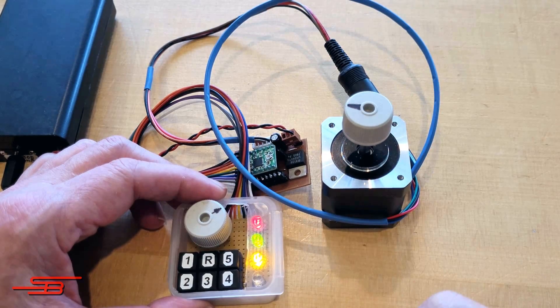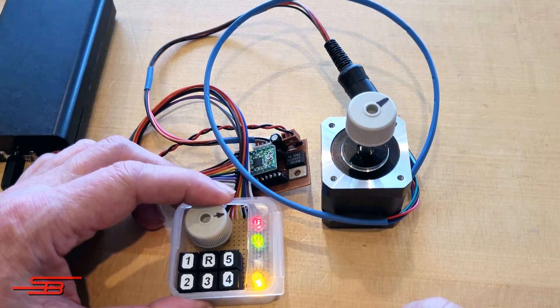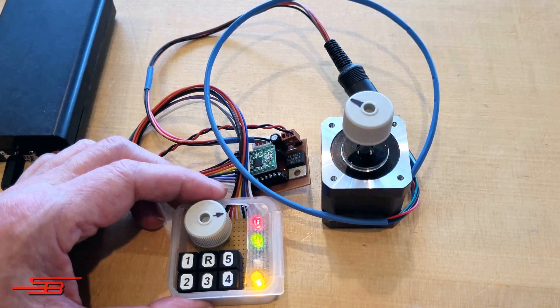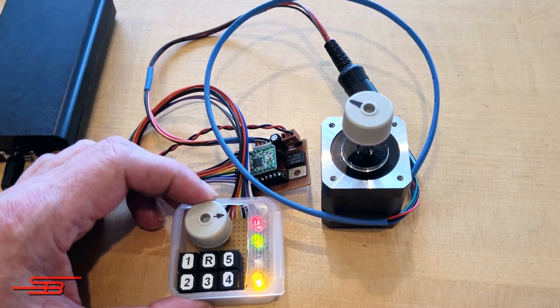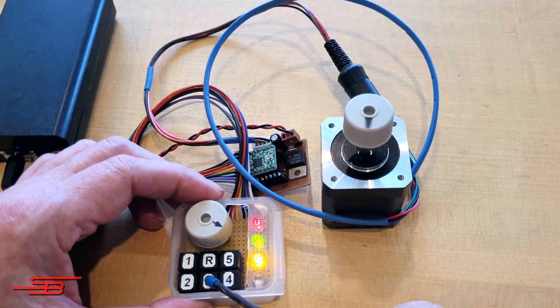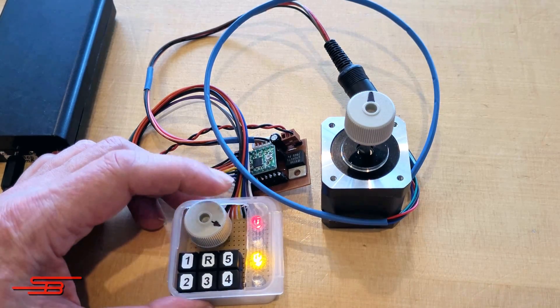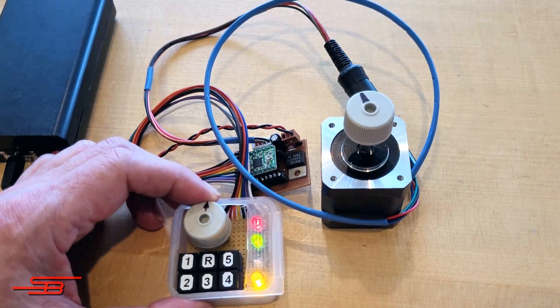Based on these 10 points, it is also possible to operate the control without a panel. In this case, the distance to be traveled is taught using the still-connected control panel via buttons 2 or 4, and then saved into the EEPROM using the save distance button 1. The currently set first speed on the potentiometer is then saved by selecting power-on state 3. For the second speed, power-on state 5 is chosen.